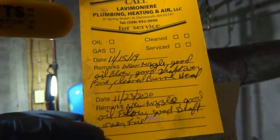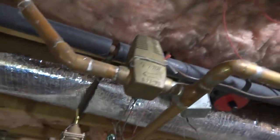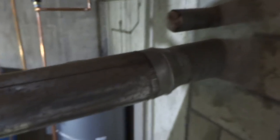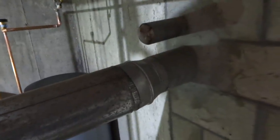Been using me for the burner service for a couple of years. One zone there, two, three, and there's another zone ahead right here, four. I found it out because it was building boiler pressure. I'd open that one too. But this, they reduced the smoke pipe down going into the chimney. That's not right. We're running the small nozzle in there anyway, so I'm not worried about it.